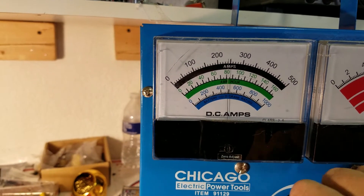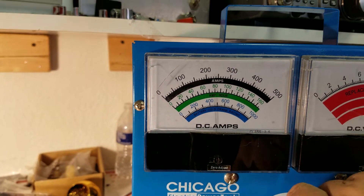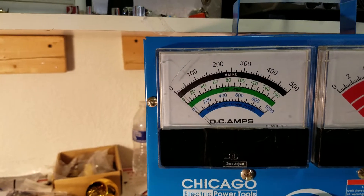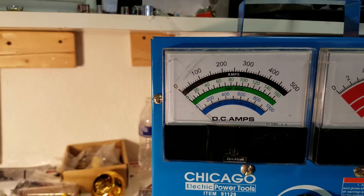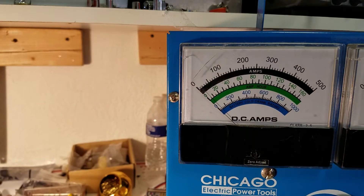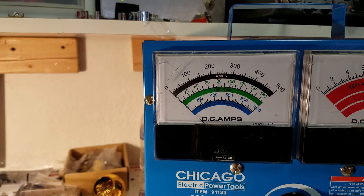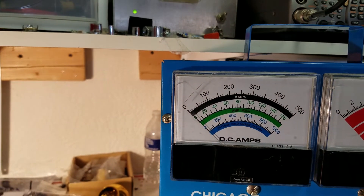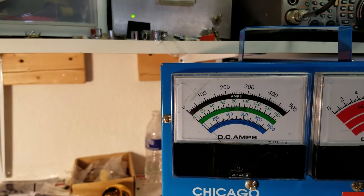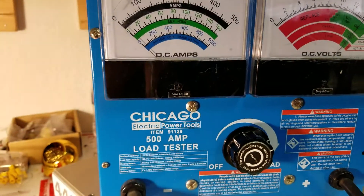If you put an amp gauge on there — like a 16-pill amp — it's gonna sit there and go over 300, doing that under modulation. Showing 440 to 450 amps continuous means it'll definitely hold up to 400 amps of amp draw off an amplifier under modulation, and it'll hold 400 amps of dead carrier too. I wouldn't recommend doing that very long, but it will do it.